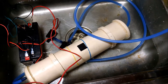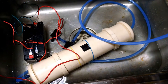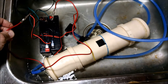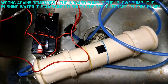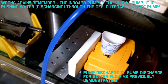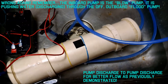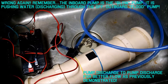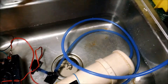It's preventing air from coming out through the induction tube. We'll be able to tell when she's fully ballasted — she'll be low in the water when she's fully flooded. The bubbles will stop because the system works with dual pumps pumping through each other instead of a single reversible pump. Now we have a fully flooded ballast tank — let's time how long it takes to empty.